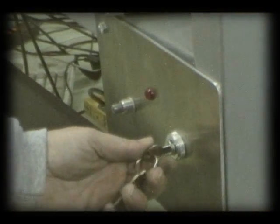Before we turn the engine over, we're going to open the valves for the dyno cooling. This one goes open completely. This one over here goes open completely. We're going to put the switches on. Crack this a little bit, just so we get some flow through the system. And then we're going to come back and set it at 40 after the engine's running and all the air purges from that. But we just turned the heat exchanger on and the coolant pump's on. Now we're ready to turn the engine on. This is the key for the engine. So, as simple as we've got everything checked, make sure everybody's clear.